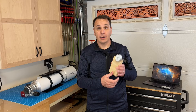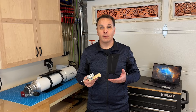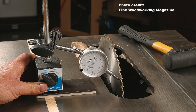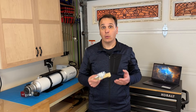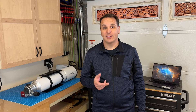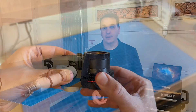You will need a dial gauge indicator, like this one, to measure the minute movements of the focuser. You can pick one up on Amazon for under 20 US dollars, and these are useful for many other purposes unrelated to astrophotography — I use mine to tweak my woodworking machines like my table saw or band saw. A digital dial gauge with metric units would make the process a little bit simpler. You will need to clamp the focuser and the dial gauge indicator securely to a stable surface — here I use my workbench. Make sure the dial gauge is in contact with the focuser, and that the focuser is roughly in the middle of its range. If needed, rotate the focuser body by hand before powering the device.